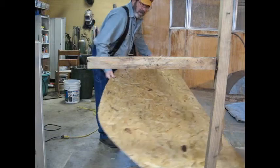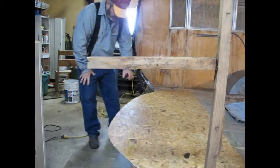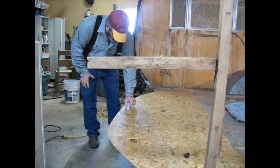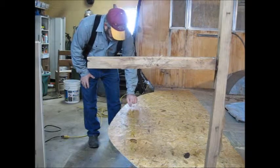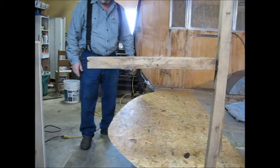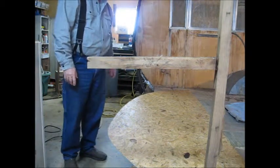There's the curvature of the back. Now what I've got to do is figure — there's an inch and a half of framing and then that one inch band. So two and a half inches in is where my framing's got to be. So I'll figure out a way to get that line on there and then we'll get it all tacked up on the side here and see what we can see.